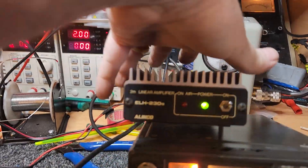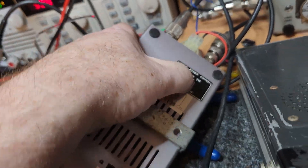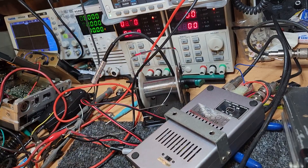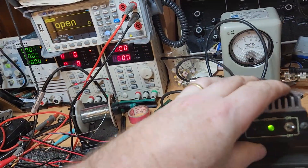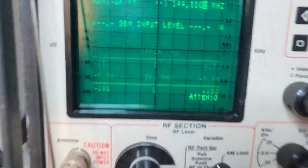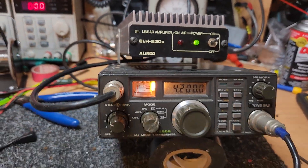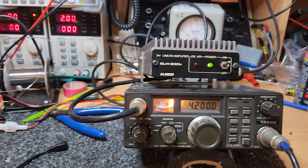Now they do have an input on here between up to 5 watts, up to 3 watts. Now in theory, if I pull that over - fingernails don't fit here, don't have fingernails at the moment. Alright, that's it. And we pop that over there - let's just see. Probably not much difference to be honest, but it might just drive that a little bit harder. It does too - 30 watts, 31.1. So by giving it the 3 watts that it wants, it actually does that a little bit better.